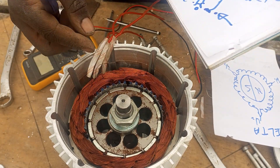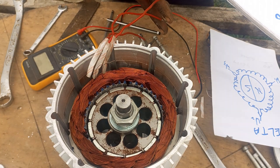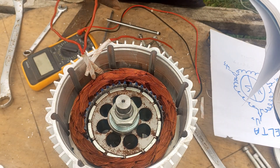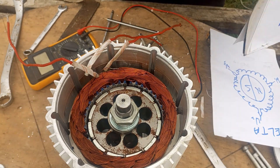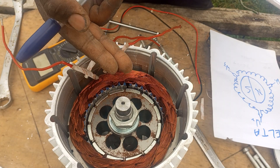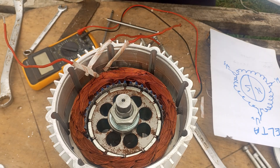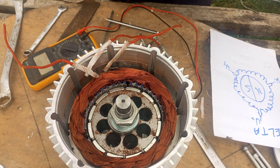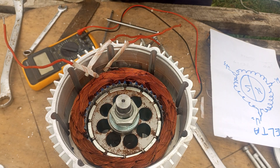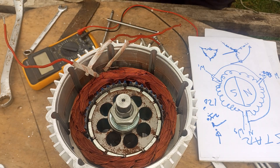The good thing about getting a wire out of here is that if I want to try the earlier configuration, I can always connect between the two output wires for the full winding output. I'm going to get a fourth wire out of this - that's going to be the neutral - giving us a three-phase four-wire configuration coming out of the PMG. Then I'm going to set it up to run at higher RPM on the flywheel. That will be done in the next video, where I'll look at the power output.